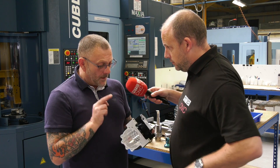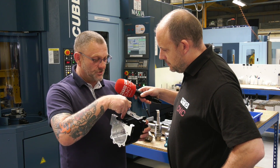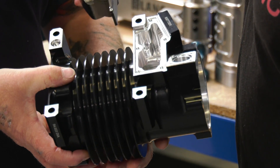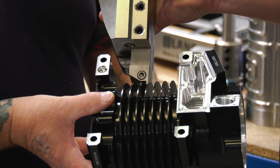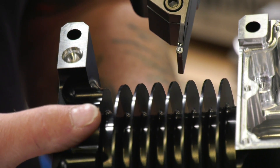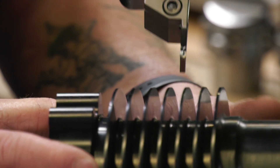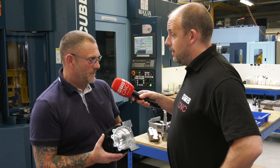And you've done this with a grooving tool. Yes, we've also done this with a grooving tool. So instead of the part stage just rotating, we've got a tool here — the part would have been spinning up at about 1500 RPM, and then this comes down the fins across the bottom and up again. Very quick in comparison with a milling machine — probably no more than 10 minutes here, whereas it'd be at least an hour on a mill.